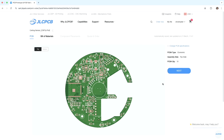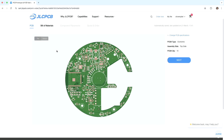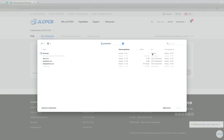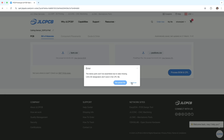If I press Next, I see a preview of the PCB — the top looks fine, but the bottom preview is wrong: everything is mirrored, and I don't know why, because my data is correct. To get PCBA service, I need to add the BOM file and the CPL file (component positions), both already exported. After processing, I get an error: C49 and C50 designators don't exist in the CPL file. That's fine — those two components aren't placed, just reserved as empty space. So I can continue.